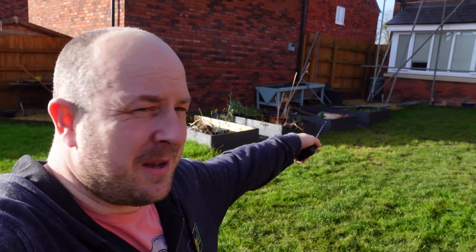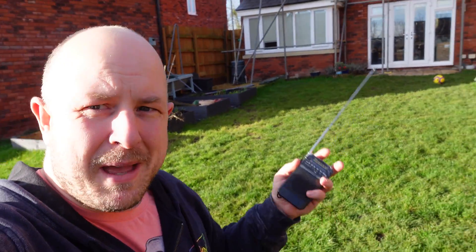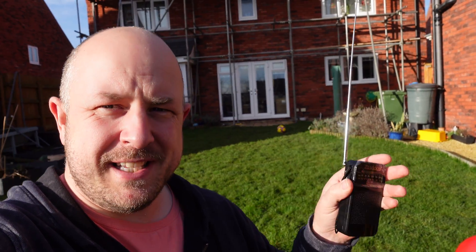I'm pretty confident the breakage isn't down the end of the garden — it's up by the house here, because that's where the slates and everything came down. We're going to try and use this radio to detect where the cable is, then hopefully dig it up with a weed tool, find the break, repair it, and hopefully we'll have the green light back on again and the mower working again when the weather gets good.